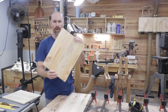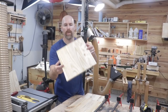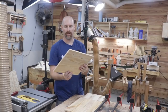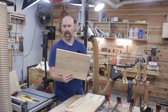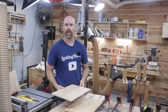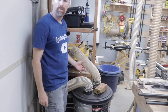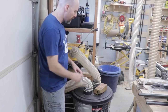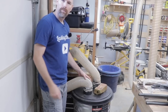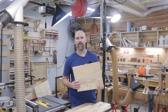If you've got some ideas on what would be a cool project to use these panels for, let me know. Using these panels instead of plywood from your local box store would be a cool idea — it saves you a lot of money, and it also reuses this really valuable material that otherwise might go to the landfill. In the last video, many of you told me that I had the cyclone set up incorrectly — you're right. I had the 90-degree fitting in the wrong place; it needed to go underneath the lid. Now it's working perfectly. I really appreciate the advice. I think we're out of time today — thanks for watching, and I'll see you on the next video.